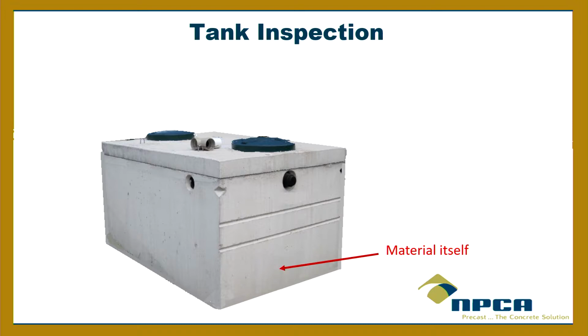Can water just get right through concrete? Well, it can eventually. Even a good quality concrete. Now, concrete's porous. It's a hard sponge, okay? It's got pores in it. Can't avoid it. A good quality mix could let water through after about maybe 2,000 or 3,000 years. That's a good quality mix. If you leave it in there and there's water up against it, so if you got a septic tank that's about 1,900 years old, you may want to check on it because it can get through there eventually. So good quality concrete should take that long for water to get through a 4-inch wall, okay?